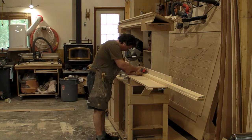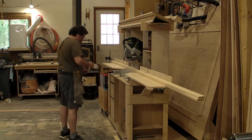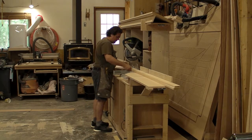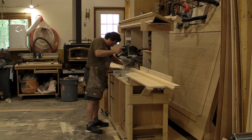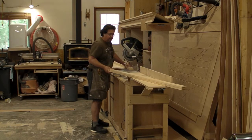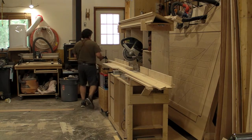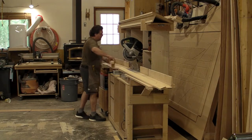The overall size of the luan on this flat is 9 foot by 2'6", and the frame is 2'6" minus the thickness of a flat, which is in and around 2 3/4 of an inch: 2.5 inch pine plus 1/4 inch-ish luan. The pine is dead on, the luan's thin of 1/4 inch. So I've cut those pieces. Those are my stiles.